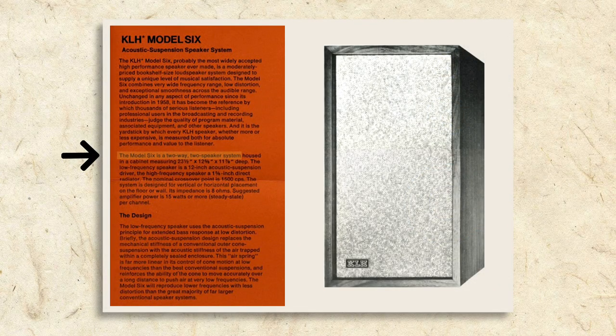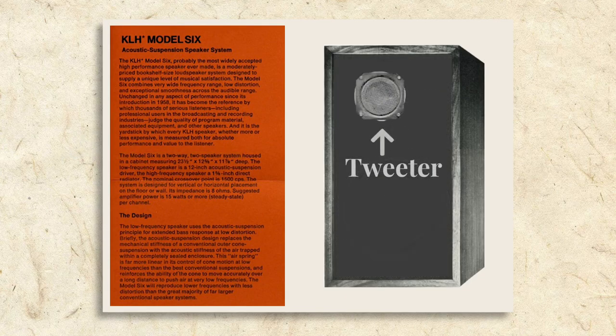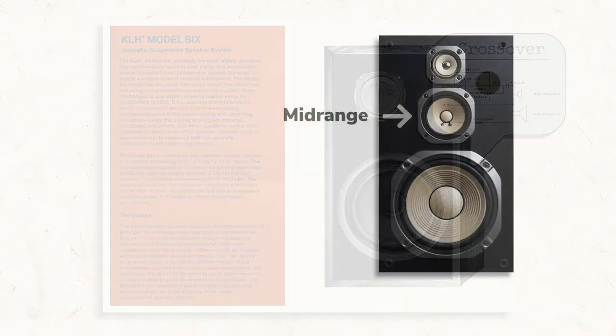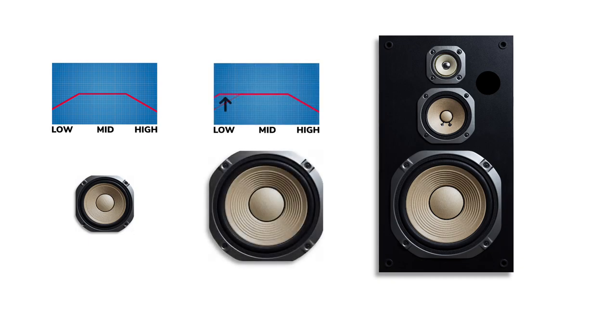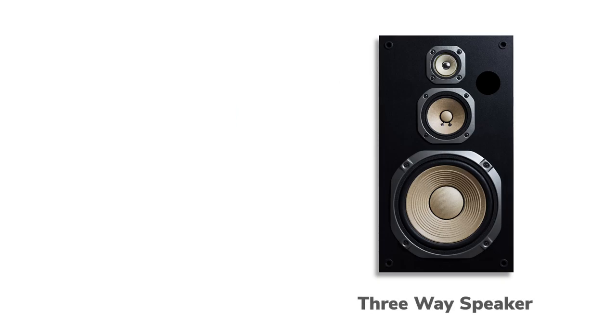Third, the Model 6 is a two-way design — two drivers: a big one called a woofer and a small one called a tweeter. The woofer reproduces the low bass frequencies and the tweeter the high treble frequencies. Inside, there's a simple electronic circuit called a crossover, which divides the signal from the amplifier into low and high frequencies and sends them to the proper driver. Some speakers have a third type of driver called a midrange, which reproduces the mid frequencies. A midrange allows a speaker to have a larger, more powerful woofer. Speakers with a woofer, tweeter, and midrange are called three-way speakers.